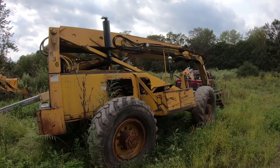So I'm not too familiar with these pencil style injectors like this, but I do believe there's supposed to be a seal right here, which there is none on this one. That would seal it from the actual cylinder itself. So just that much goes into the cylinder and that seal seals it up. So I think what happened here is that one went bad and it disappeared somewhere. And then I think what happened is because of the pressure, this one went bad after that. I'm just speculating, but I firmly believe if I replace these seals, I'm going to end up with a lot better compression and I'll probably end up with no smoke.